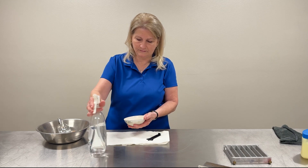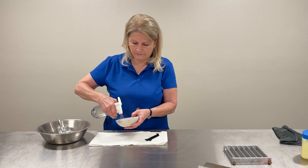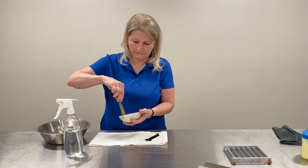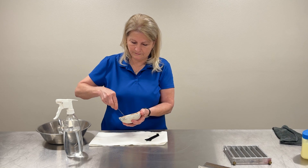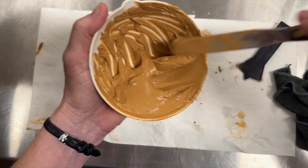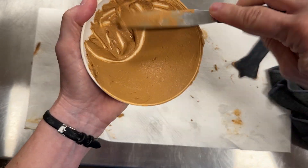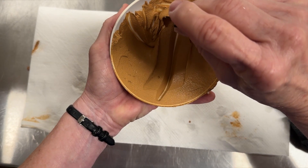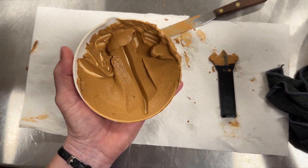It is very important to mix the soil and water thoroughly and uniformly. Test wet soil for the proper molding consistency by shaping the sample into a smooth layer about 0.5 inches thick on the bottom of the dish and making a groove with the grooving tool. If the material immediately flows of its own accord and just closes the groove at the bottom, the sample is ready for molding.